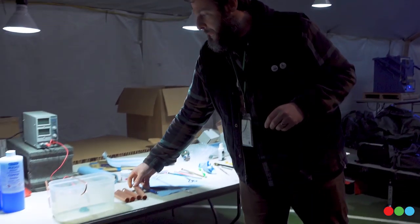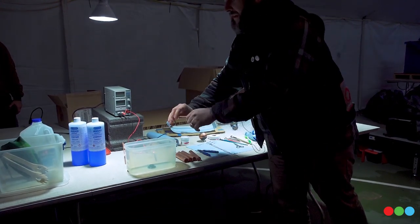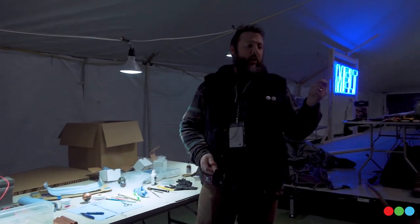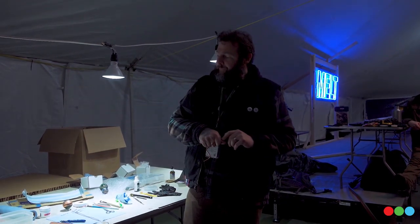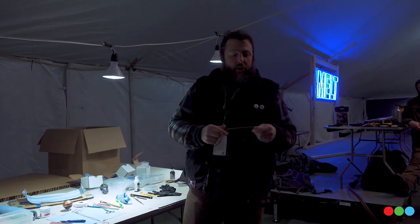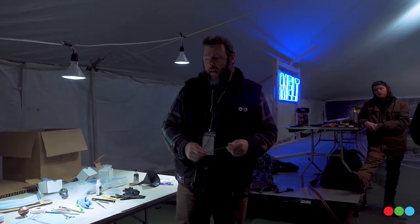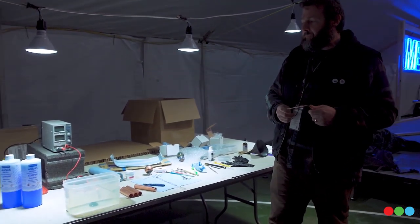The wire that I'm using here for my bars, technically, this is tube or pipe. They refer to these as bars. Anything that holds your anodes, the technical term within electroforming would be bars. But this is just from the hardware store too, and this is just grounding wire, just standard. You can get it by the foot, and you only need like 3 feet to put together one of these small baths.